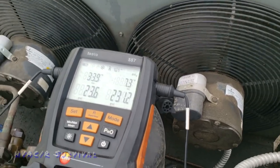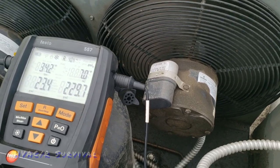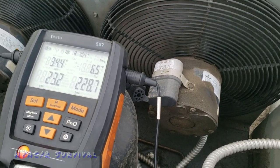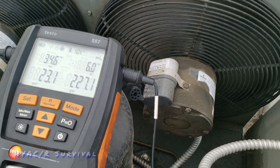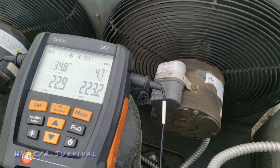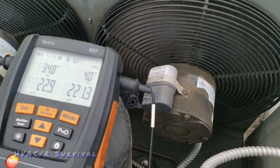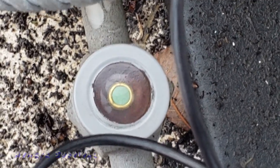Just something to keep an eye on - it doesn't hurt. I had an instance recently: rare contamination in the system. Once I put my clamp on to check sub-cooling, I saw it had 30 degrees of sub-cooling, yet I still had an empty sight glass - or partially not a full sight glass. That told me, in combination with some of the other conditions, that I had non-condensibles, because no matter what I couldn't keep it solid.